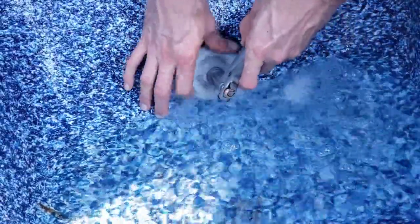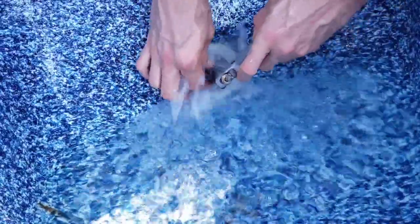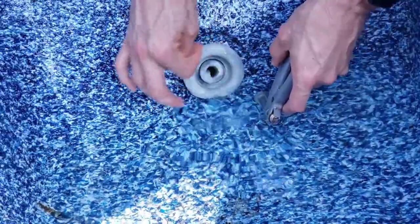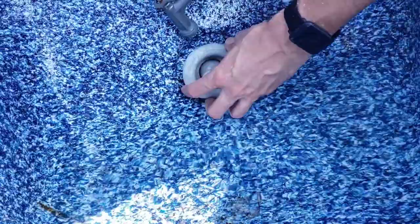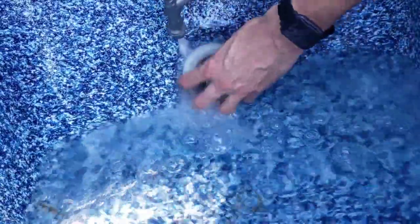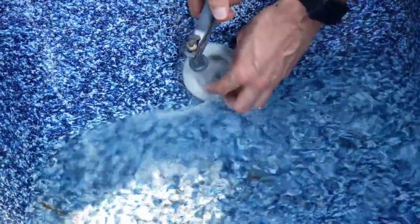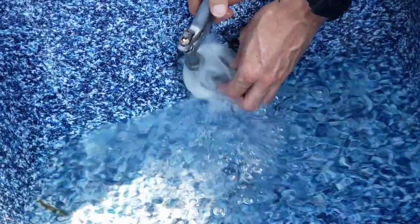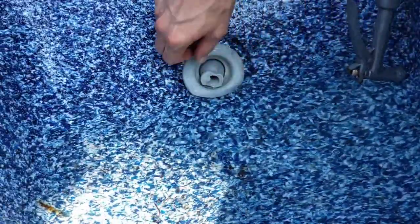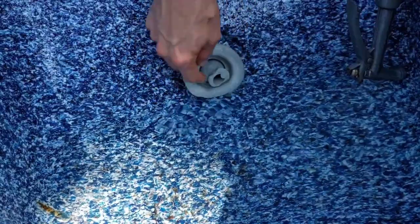Work it free back and forth — it'll end up cleaning out the bearing too, which usually gets jammed up pretty easily. Afterwards, squirt around the edge and squirt in there. Again, you can do this while the hot tub is full underwater as well. Now you can see how free this is to adjust and spin.